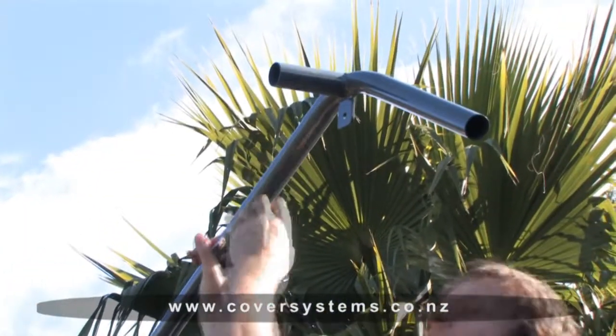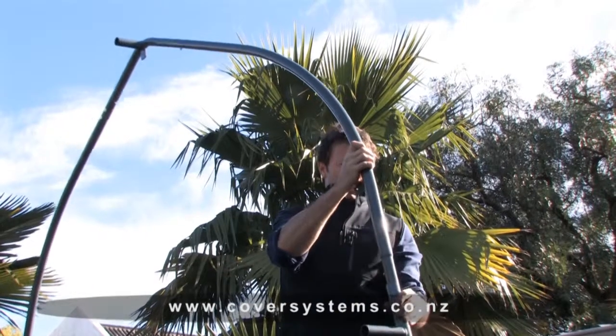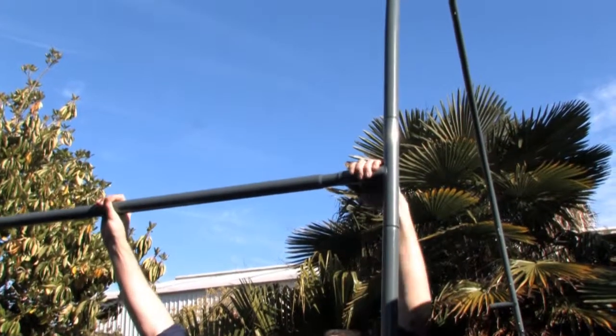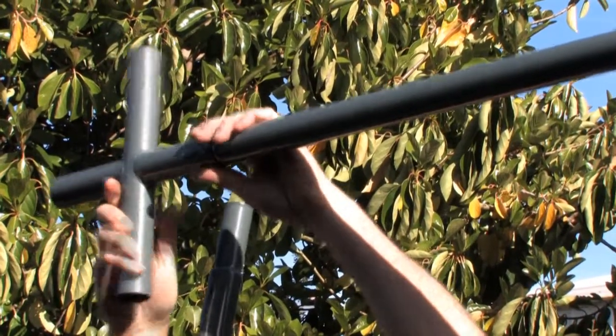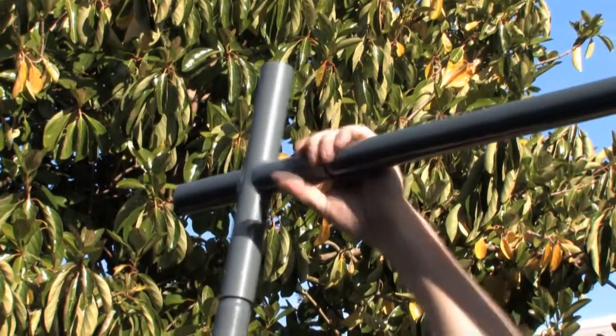The 3-way fittings are for the roof end. Clip these together by pressing the lock button in and push into the sleeve until locked. The 4-way fittings connect the leg rafter to the roof rafter and purlins. Connect the top purlin to the roof rafter.